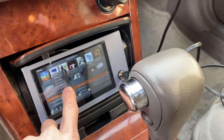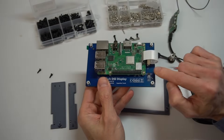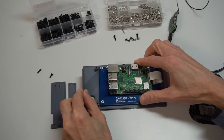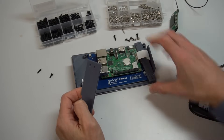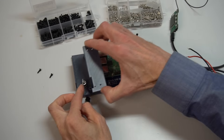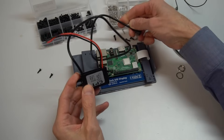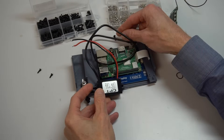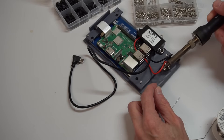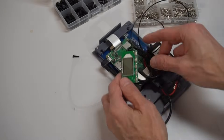Let's look at the CarPlayer first. It uses this 5-inch touch screen with the Pi 3 mounted on top. I designed and 3D printed the faceplate to match the empty space in the dashboard of my car. I also printed some small brackets to hold the screen assembly in place. 12 volts from the car's cigarette lighter is connected to this jack, which feeds a 12-volt to 5-volt converter that plugs into the Pi's micro-USB power jack.